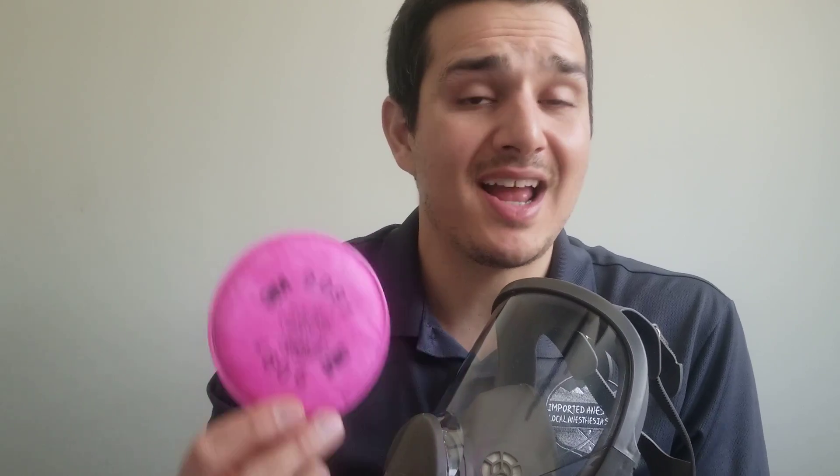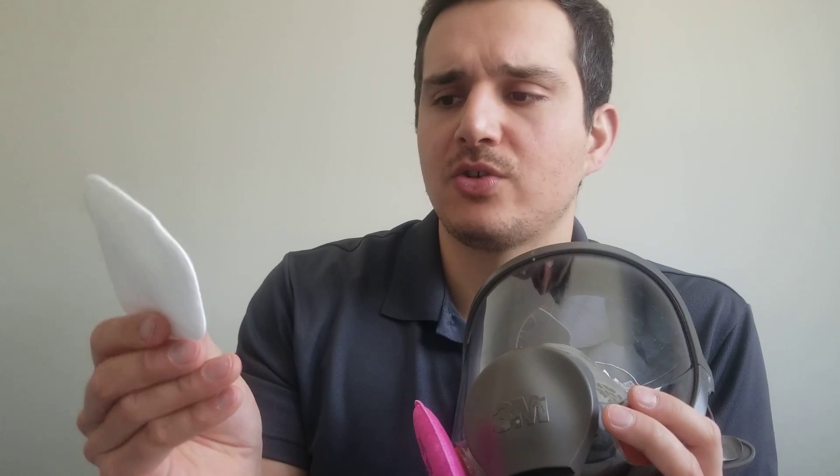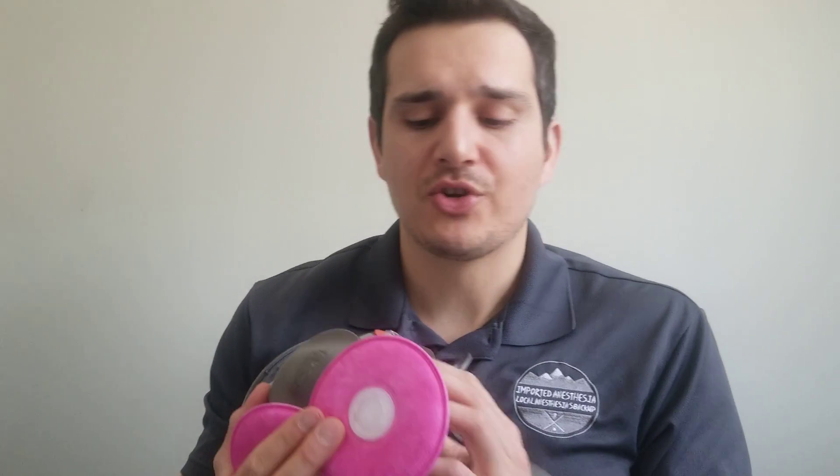The other type of filter to mention is less bulky. I have a 2091 filter from 3M, which I think is superior because it's a P100 — 99.97% against 0.3 microns — and it goes directly to the mask, unlike the previous filters that require the vapor cartridge first.